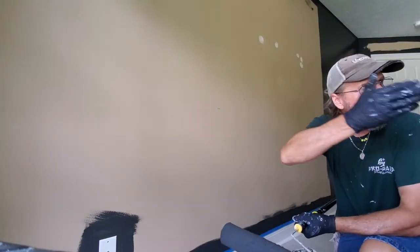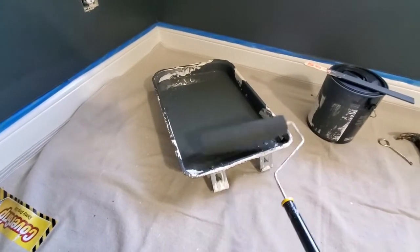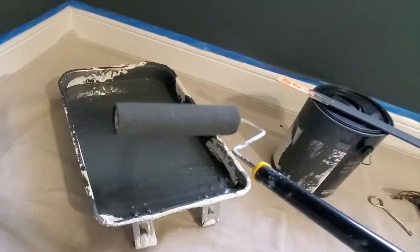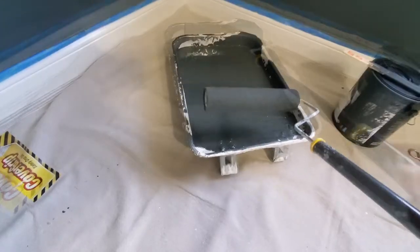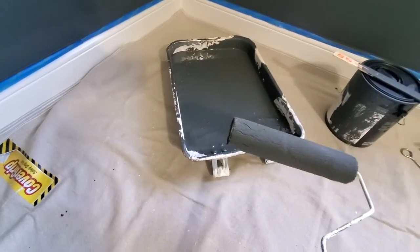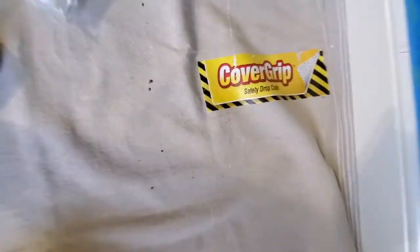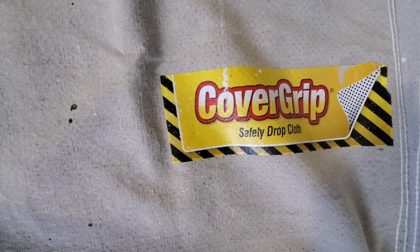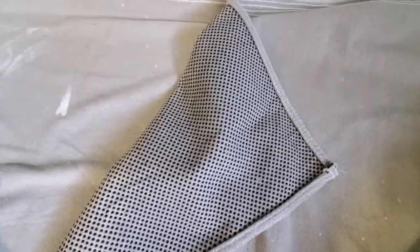Continue doing the wall and go all the way around. Use a jumbo extra-large paint tray — a lot of trays are much smaller, but this one gives the roller room sideways and can hold plenty of paint, almost a whole gallon. Also get good drop cloths. These Cover Grip safety drop cloths are really nice — I use them almost exclusively. They have rubber tips on the bottom that keep you from slipping on hardwood or tile floors.